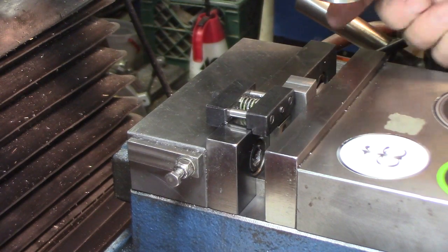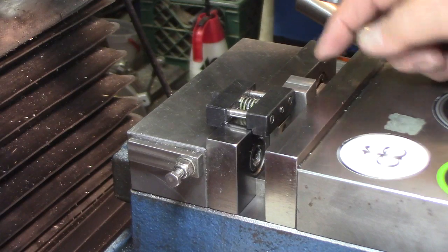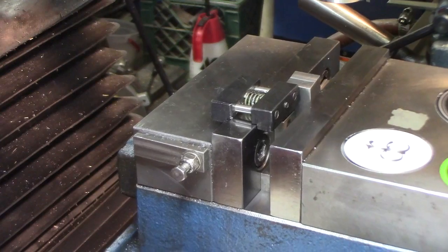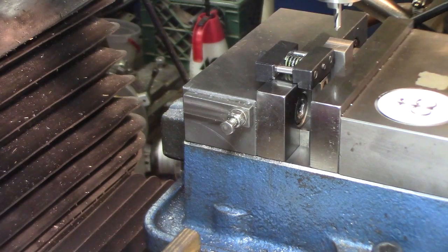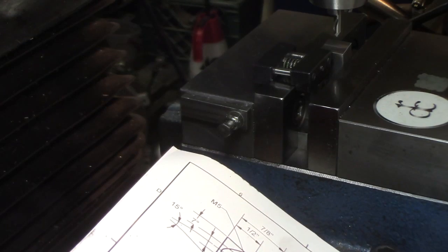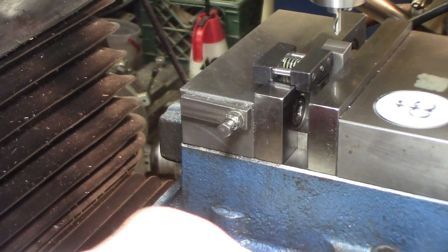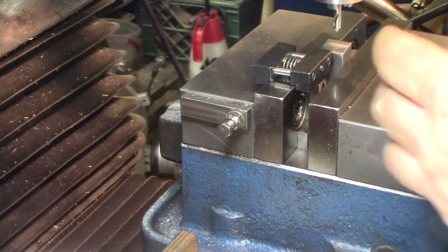Spotting drill in — quarter-inch one — I'm just going to eye it. There are no real dimensions on here about the hole other than the diameter is a quarter inch, no depth of the hole or anything, other than they show most of the depth almost all the way down here to the shoulder.